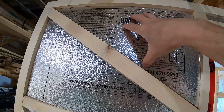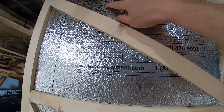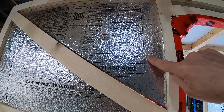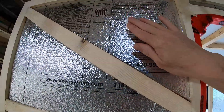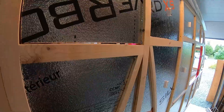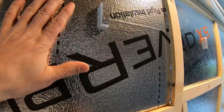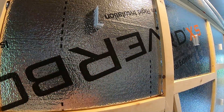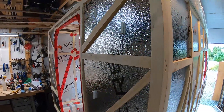The insulation is an inch and a half thick and I don't really want it touching against the aluminum on the outside — I'll keep a little bit of a barrier for some airflow. This strip is one inch thick, this one is a half inch thick, and the walls are an inch and a half — you can do the math. I'm just going to go around and put one little dot on each location, some maybe two. They look a little silly but they're holding in place, and again it's to keep the insulation off the aluminum for airflow. Is it needed? Don't know, but that's something we're doing here.